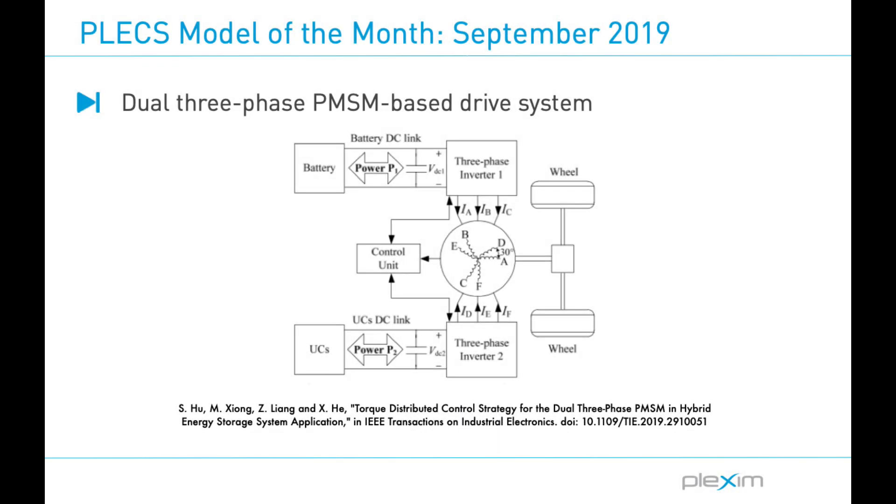This schematic shows the dual three-phase PMSM-based drive system with parallel DC-link fed inverters. The first inverter is sourced by a battery, and the second by a set of ultracapacitors. Torque control for the separate inverters allows independent power generation back to the two storage systems. A feed-forward compensation with the machine speed and current differential term is required for the decoupling, meaning the dynamic performance of the machine is subject to the accuracy of these measurements. The author uses a voltage model flux observer for the voltage calculation, and offers a thorough analysis to arrive at a flux decoupling compensation that is less complex than previous proposals.